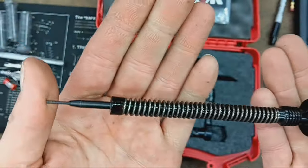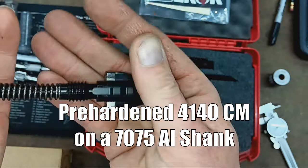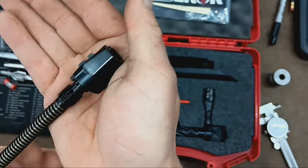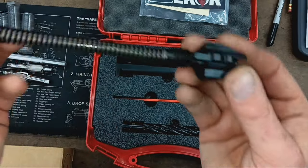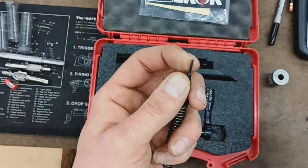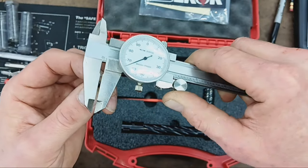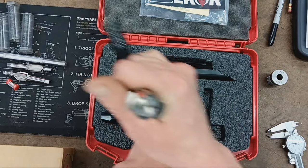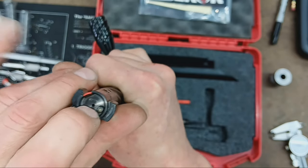And then you've got your firing pin assembly. Typical Remington 700 style there, right down to the threads, cocking piece, everything else, with the exception of the shroud. Okay. We're looking like probably a 6-2, yep, 1/16 inch firing pin. So a reduced firing pin in diameter. That's very nice to see. Same with the hole. Very minimal clearance there.